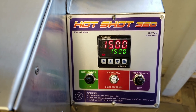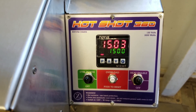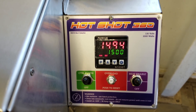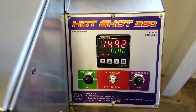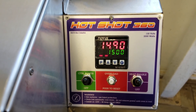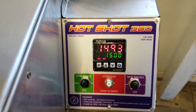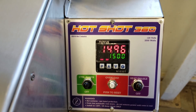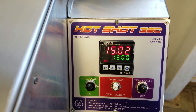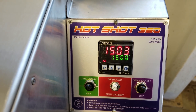Watch what the actual temperature in the oven is doing. Without the PID set, it's basically just set up for on/off. The temperature is coming down, and as soon as it gets below the set point it's back on. There's some lag — our dip in the system is 1489. Now it's climbing back up, the output stays on until we hit exactly 1500 — and we've overshot. The temperature inside the oven is on a roller coaster ride.